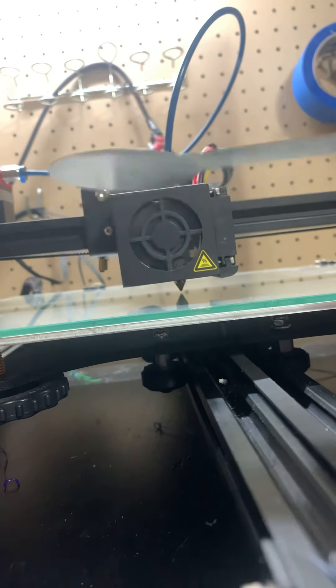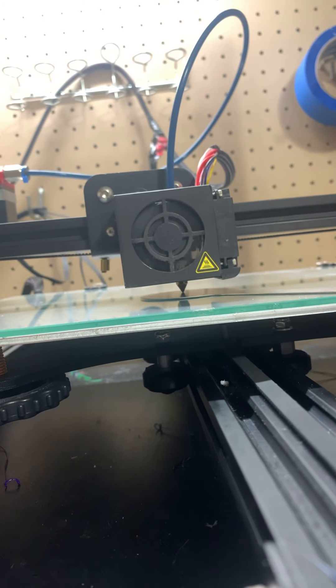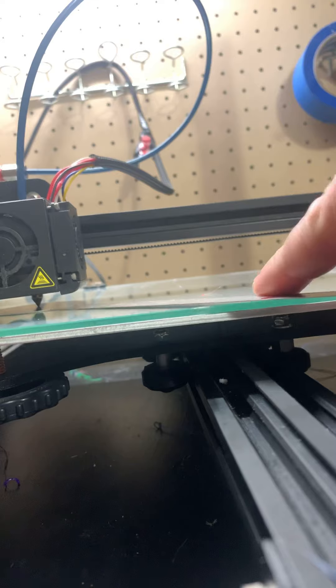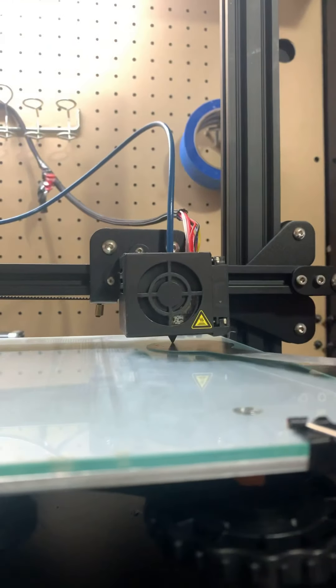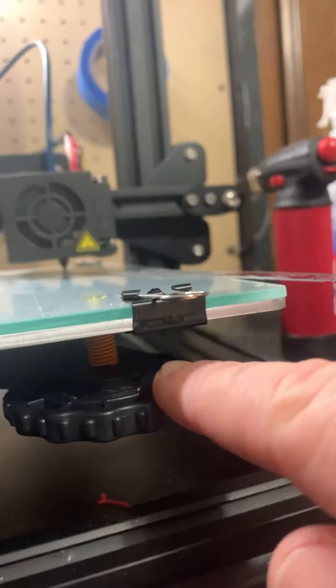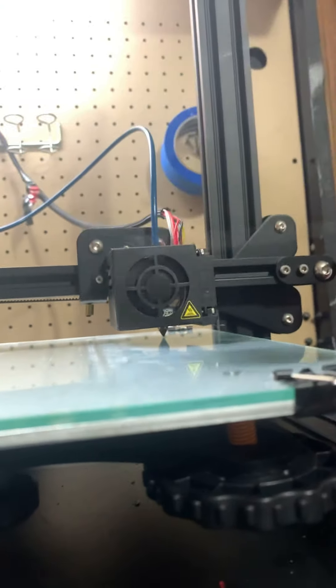I've got this very expensive caterpillar tool that I use as a feeler gauge. You slide it into all four corners and make sure it's consistent. Pull your bed forward — consistent. Because what happens over time is your rollers can get a little out of alignment, or these adjuster screws can back off.